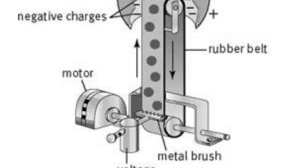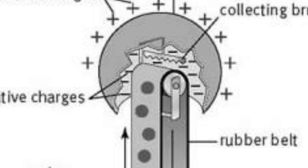The positive charge on the belt being deposited onto the top roller attracts the negative charge from the teeth of the comb attached to the shell. This causes a net positive charge to develop on the outer shell and will continue charging until the Van de Graaff comes in contact with a grounded object and is discharged.